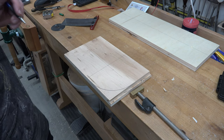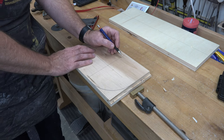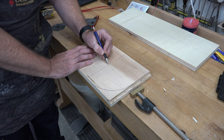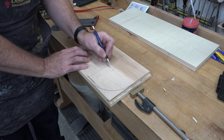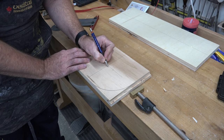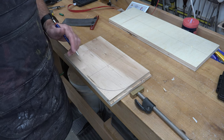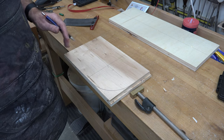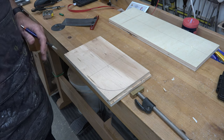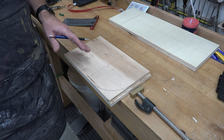I need a three-quarter inch wide dado that will house the dowel for the roll, and it has to come right across that center line. Right at that center line it has to drop down — maybe about three-quarters of an inch, maybe even one inch — and that's what will hold our roll in place. To do this we're going to head over to the router table and I'll show you what I have in mind.